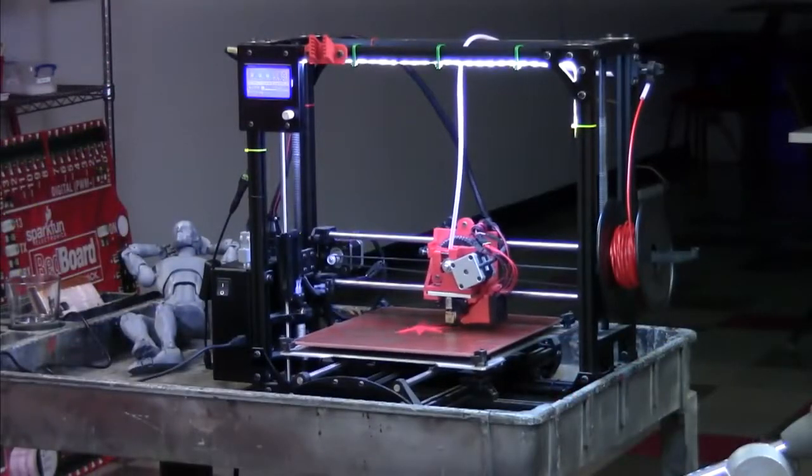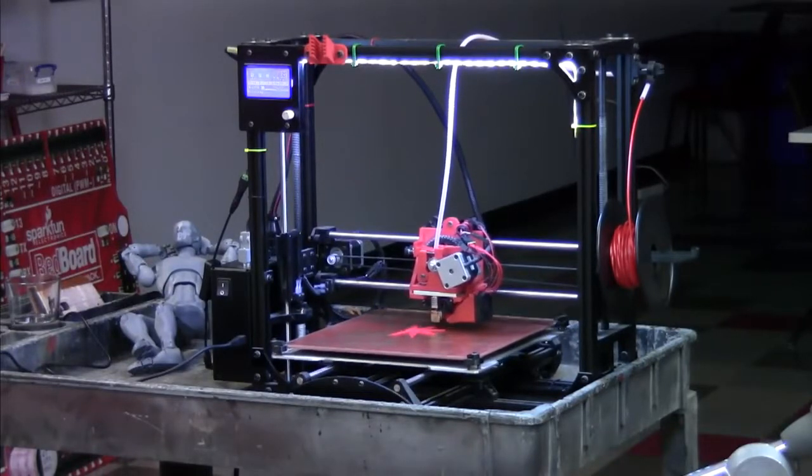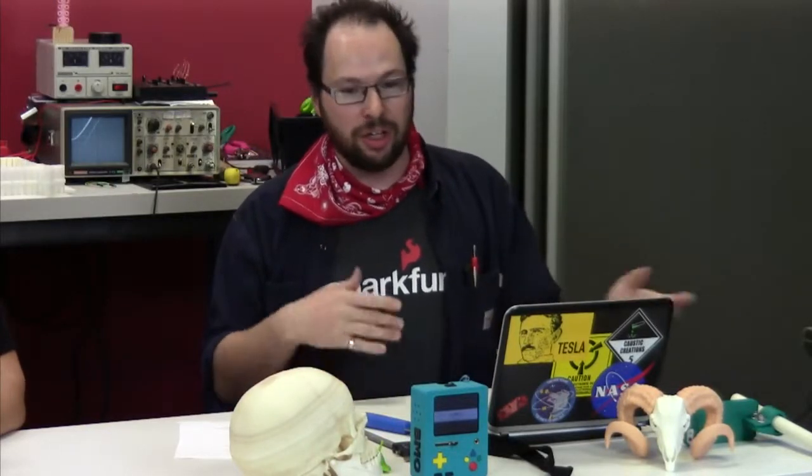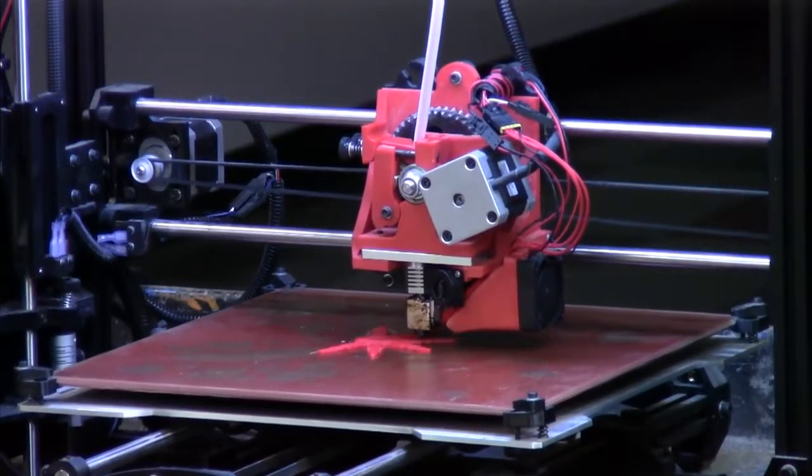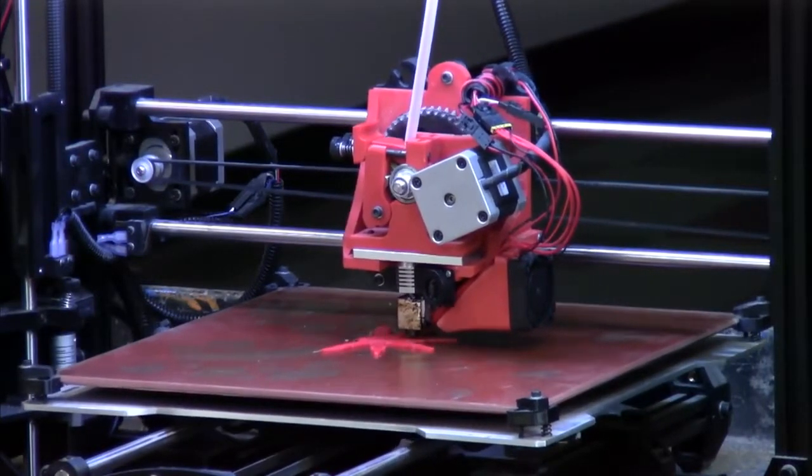Another problem that we can run into is with bed adhesion. Sometimes, like I said, with the curling, pieces lift. Sometimes a part will lift off the bed altogether, and it'll just grab onto the nozzle, and then it makes a mess. Your part doesn't come out. That's no good. The bed temperature is a good way to keep that controlled. For ABS, the Lulzbot recommended temperature is usually around 110. I like to go 115. That's a little bit hotter and it stays on the bed.